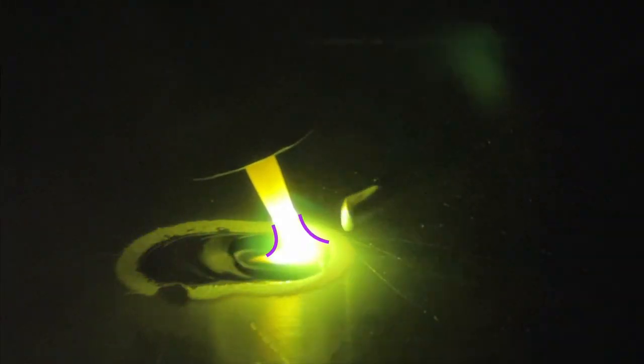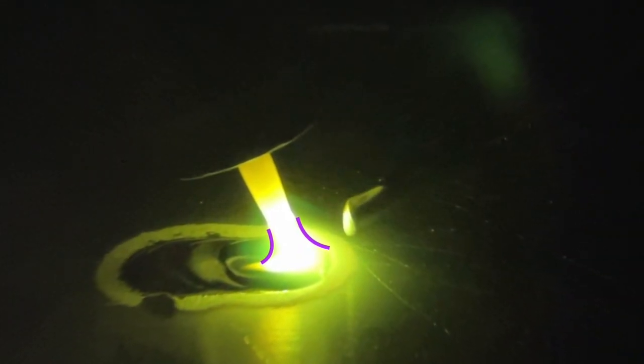So you can see in this pass here, look how nice and close I am to everything. I'm in nice and tight. Again, give or take a little bit the thickness of the tungsten, but I'm in nice and tight. Look at the shape of my arc cone here. The shape of my arc cone is relatively uniform and everything is nice and close and compact to the weld pool.